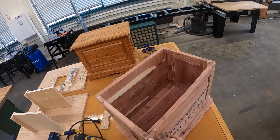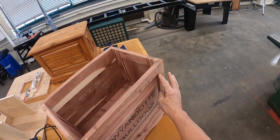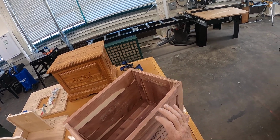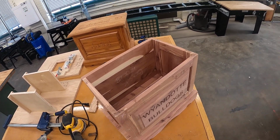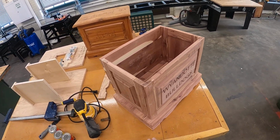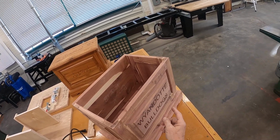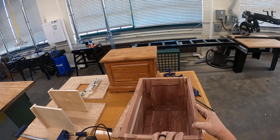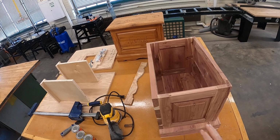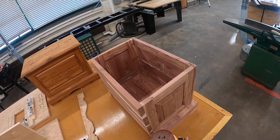You're going to want to slightly sand all edges. We don't want any sharp edges. Right now they're machine sharp, where we cut them with the machine. So it's mostly hand sanding from here. You could probably use the orbital on the front of the feet, but for edges and sanding inside, it's mostly going to be hand sanding with a sheet of sandpaper, the block sandpaper. Wherever you can, go ahead and use the orbital.